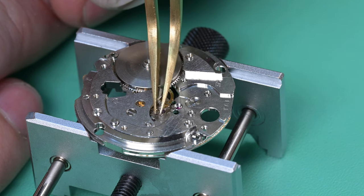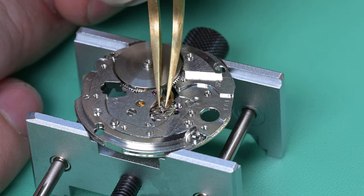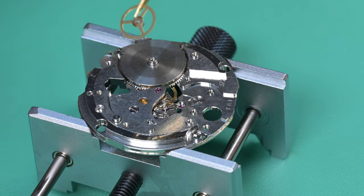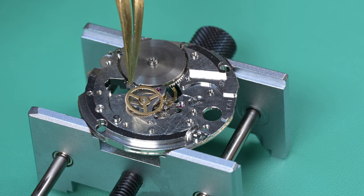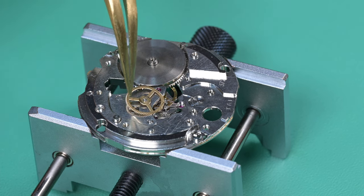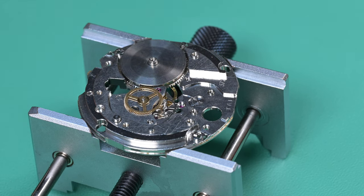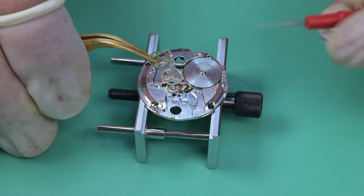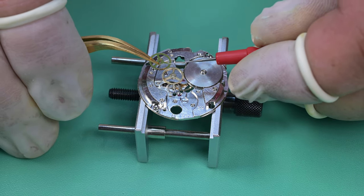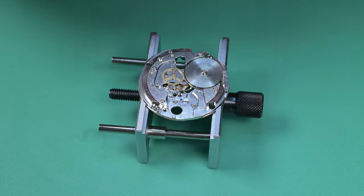With this new camera view, I really think that looks good. We're going to install the escape wheel first and let it sit down in its jewel. Next up is the third wheel — I hate that wheel; I can refer you to some of my previous videos to explain why. Some returning viewers will have caught the joke on that. Here I'm lubricating the pinion on the fifth wheel and we're going to go ahead and get that put in as well.